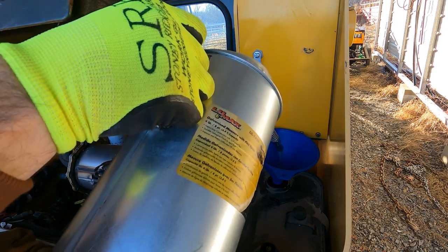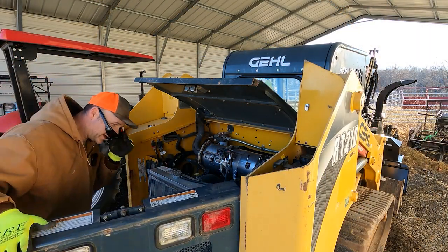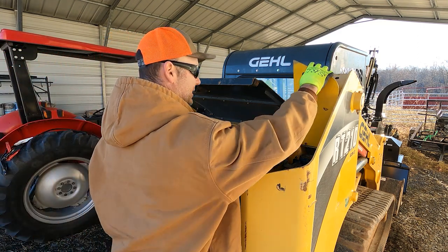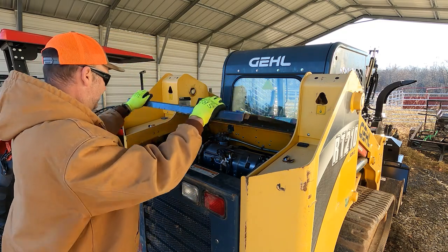Approximately 11 gallons. So if we're a couple gallons low in this cold weather, it's gonna take a minute. So we took about 2 gallons to get 3/4 of the way up. And the fluid looks, to me, a little milky, which means it might have a little bit of condensation in the tank. So she's due for a service.